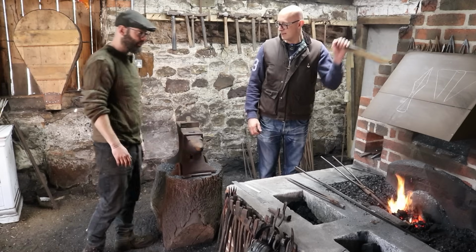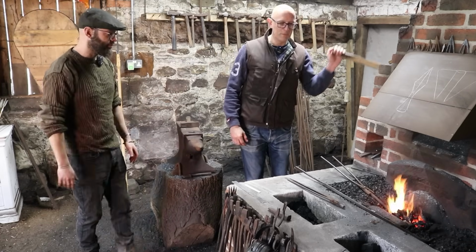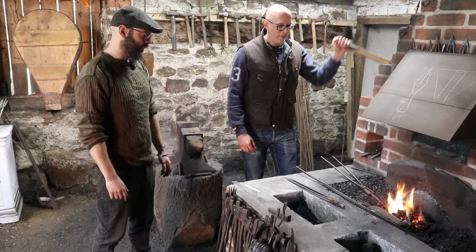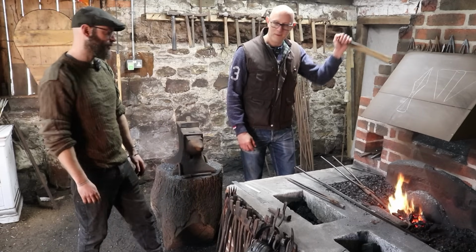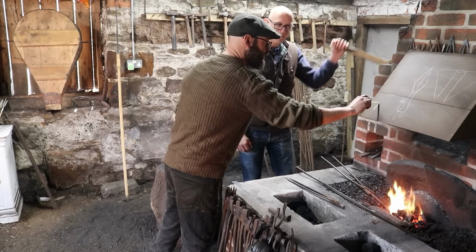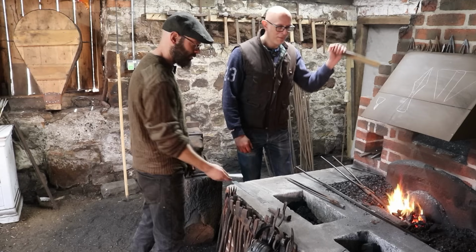Oh, okay. So putting essentially lots of divots in it. And it will only move in one direction that way, rather than it being wasted by being spread out. Right. And of course, as you said, it will heat up now quicker because it's thinner. An arrowhead, to get from your square bar of an arrowhead into that shape, that's 1 heat normally. Right. So we can time it. You can see how many heats this will take, but it's very different.